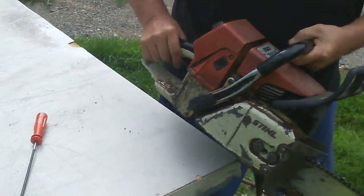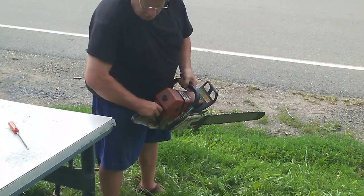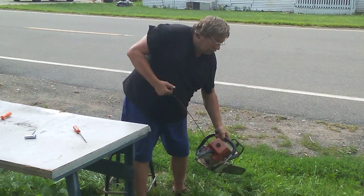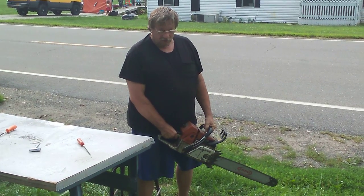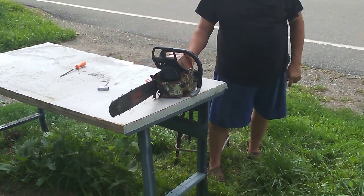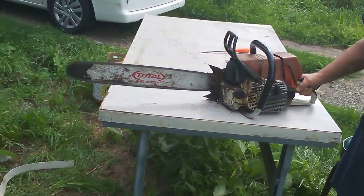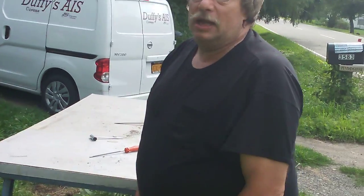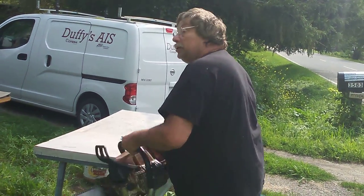We've heard so many hot saw starts — let me show you one that ain't hot, just a regular old '66. A lot of people don't like these switches but when I build yours I fix that so it's easy to operate. If it chugs out, you're too rich. If when you're bringing that throttle up it has a soft spot where it wants to bog out before the high jet takes over and you feel that — that's too lean on your low. Thanks guys, that's it — have a good one.